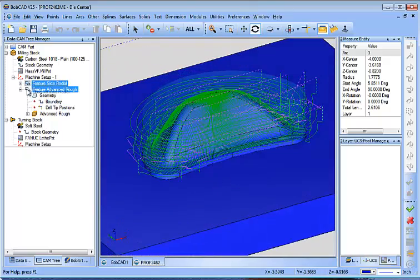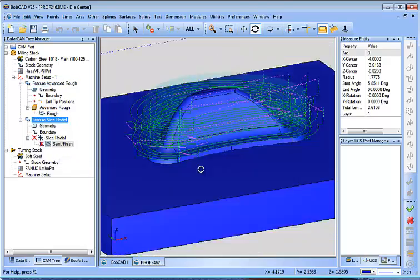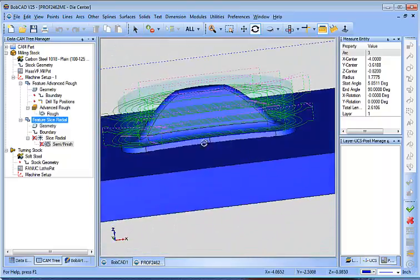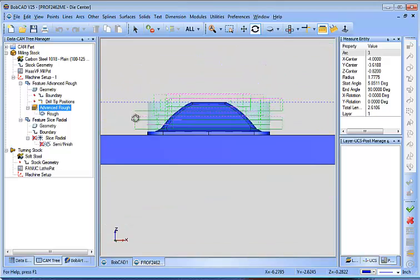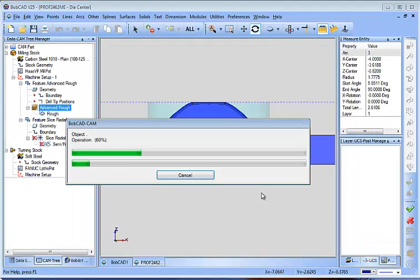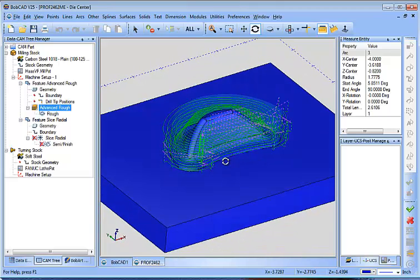So my step downs and step overs may not be dialed in for what we're doing here, but you can see this path is going to be more of like a 2D pocket where it's going to work its way in from the outside and step down. I would use something more like this for a roughing routine and you will get a stair step here. But if we look at this from a front view, you can see that these paths out here are my step downs, and then you see these other paths — those are your intermediate slices. You can even make that as much as five, and that's basically doing a semi-finish on the part — re-roughing those areas. Kind of like a combination of a Z-level rough and a Z-level finish.